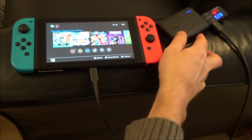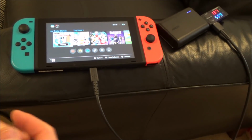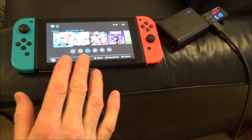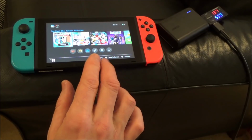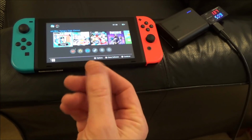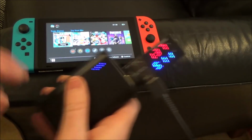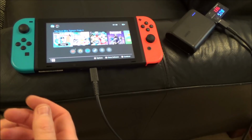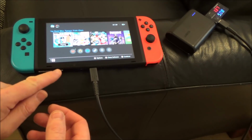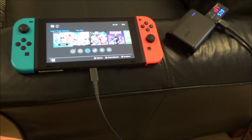I have absolutely loved doing this video because it's given me a chance to change some chips out and I was successful with it, and it was so nice when I finally saw that screen come on. So by changing that very last chip that was faded underneath, the charging IC, we then had the 0.4 amps come up here. The reason that I couldn't get anything on the screen is because I didn't have the backlight turned on. So basically the screen was probably working, but we couldn't see anything. As soon as I did that, it came on.